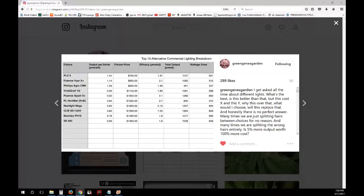The issue comes with what fits with drivers. Being at close to 70 volts, the C doesn't always work with drivers. So if you're using a less efficient driver, it ends up canceling itself out. So between the B and the C, honestly, it's what works for your design. You're not going to be sacrificing anything major either way.